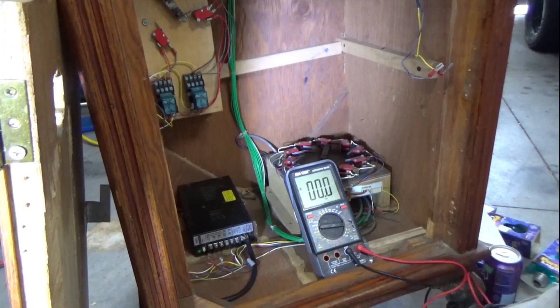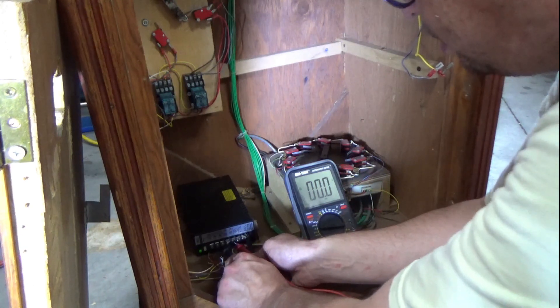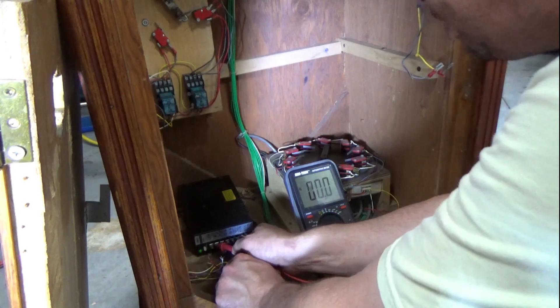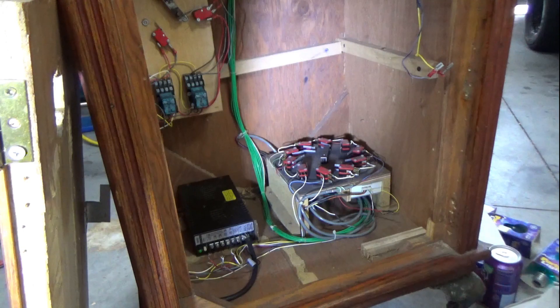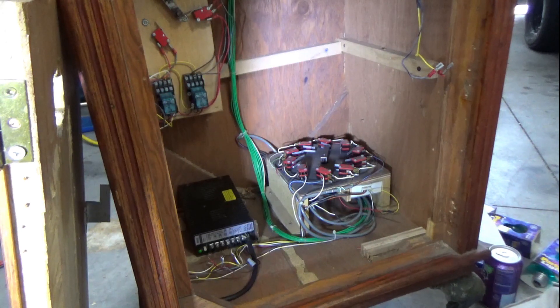I do believe that power supply has a problem — and so does my screwdriver, tip's broken. Nothing plugged into it now. I should have negative five volts here but there's nothing there. Something is wrong with this power supply — 12 volt I have half voltage, probably on the five now too, yeah two and a half. So the power supply is shot. Let's take it out and check if maybe there's a fuse. I don't know why I would have half voltage unless one of the MOSFETs blew and it's only got half the voltage rails running. Let me get this randomizer out.